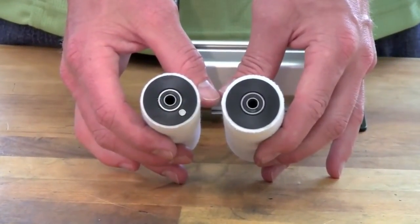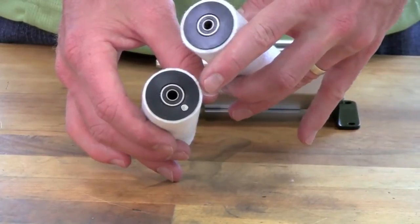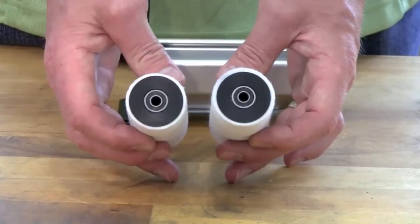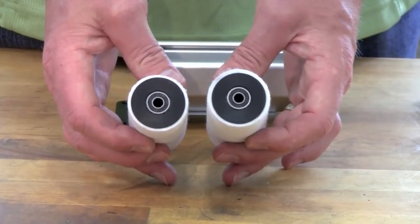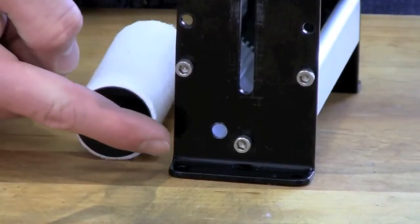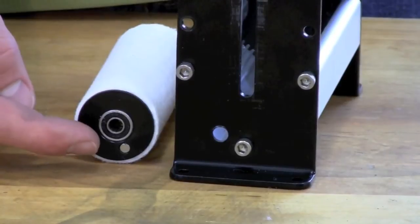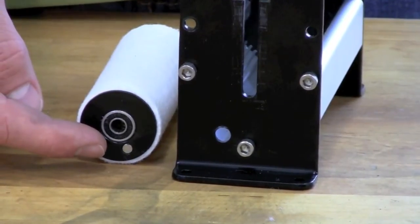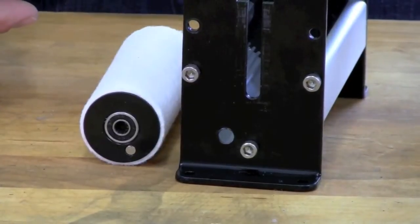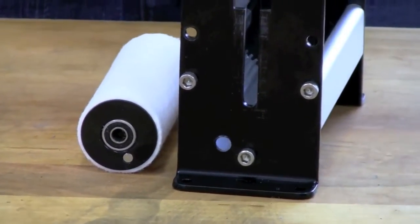Now that the end caps have been installed on the new roller covers, note that one of the four end caps has a magnet pressed into it. This magnet is used to trip the roller rotation sensor, which provides an input signal to a UNIST SPR2000 control panel. It is important that the roller assembly with the magnet be the lower roller, and that the end cap with the magnet be on the same side of the unit as the M8 tapped sensor hole located on one of the end plates.